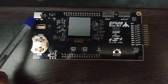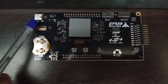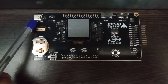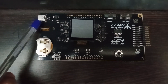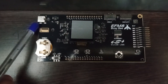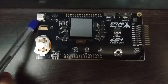The specialty of this board is that if you want to debug the EFM8 BB5 microcontroller, you do not need an external debugger. The board itself has a built-in debugger. You can use the USB Type-C connector with Simplicity Studio to debug the microcontroller directly.